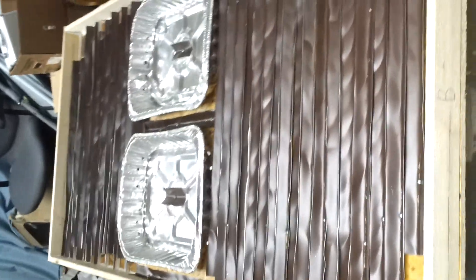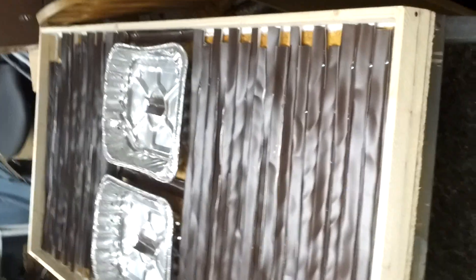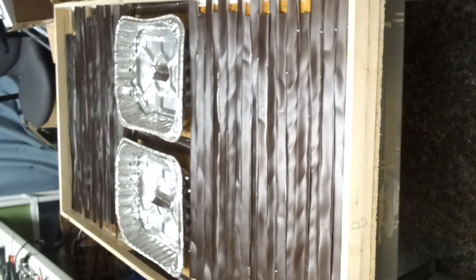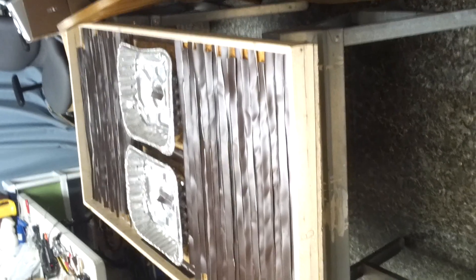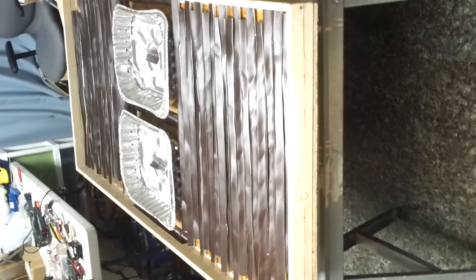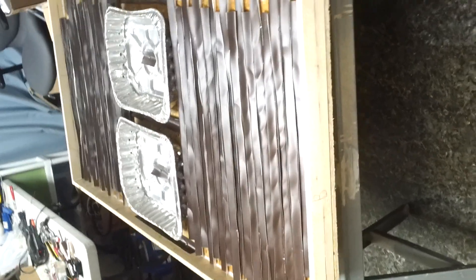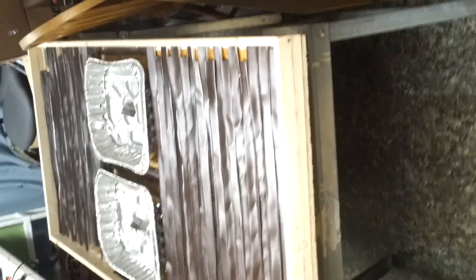That's a really simple panel. The thing I like about this style is I don't have to collect a bunch of cans, wash them out, and everything. Aluminum is really not that expensive — you can get a roll of aluminum in the upper 60s to lower $70 range, which will probably do four of these type of panels. So instead of playing around with pop cans, you can do this and it generates just as much or more heat depending on your design. I didn't want to go with pop cans and all the washing. I want new materials as much as possible.